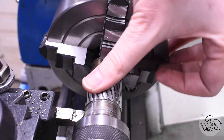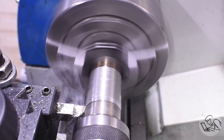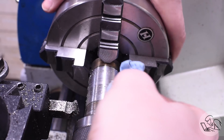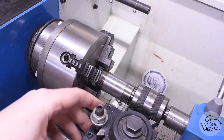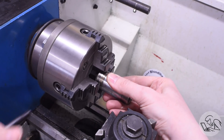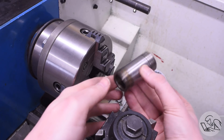A few passes later I've successfully demoted it to knurling, so we're almost done. I have to say this is machining really nicely. I don't know what this collar is made of — the hardness tester can't tell us anything about the alloy, but the surface finish came out great with very little effort. Maybe the more knowledgeable folks out there can comment — maybe 1095 or 1144, or whatever they make golf cart transmission input shafts from. We're left with some grooves I presume are clearance for the gear hobbing machine — I'll just leave those in as nice little art deco details.